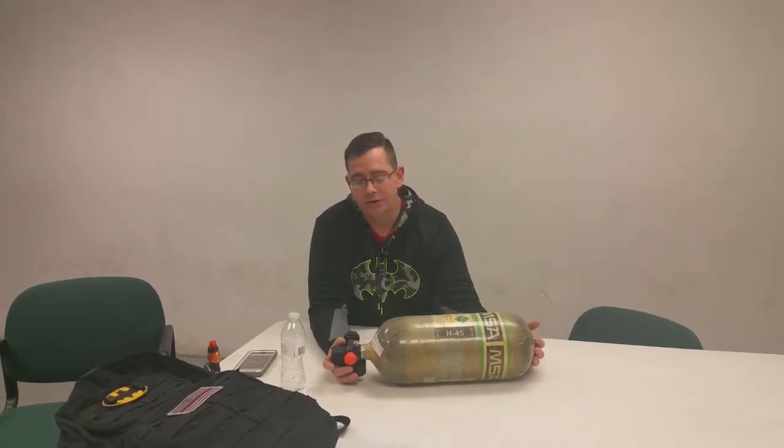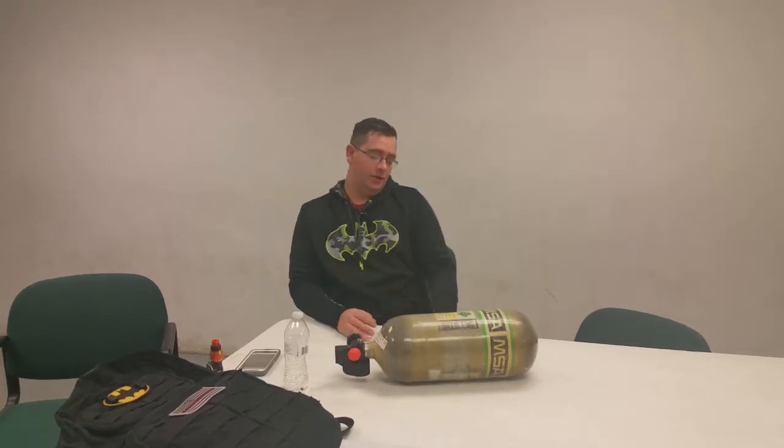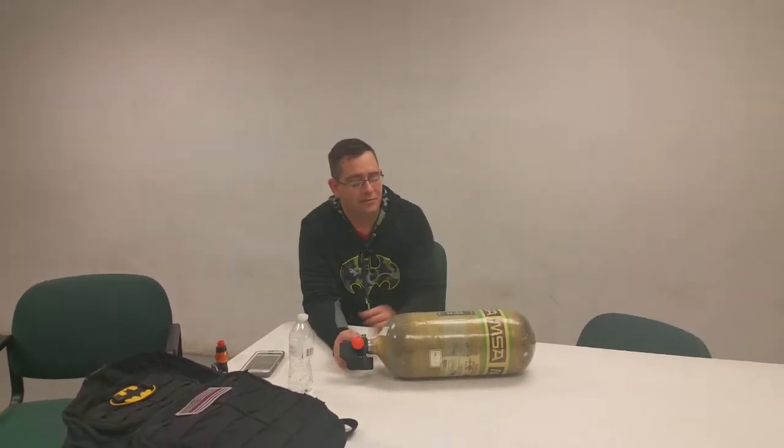This could be used for multiple different uses. One is our breathing packs, so that we have air to breathe and aren't inhaling all the carcinogens. Another is to power airbags for extrication, lifting, shoring, whatnot. Each department has different manufacturers, different bottle styles, different bottle pressures. So if you are on a fire with a mutual aid department, make sure you know what packs and bottles they have, so you don't just grab their pack off their truck and it doesn't work.